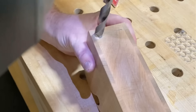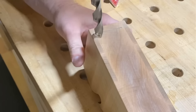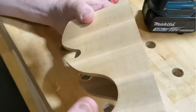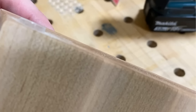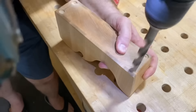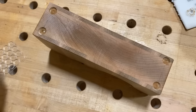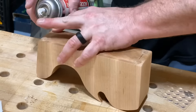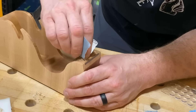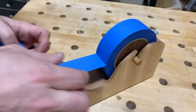Moving on, I'm going to place some non-stick feet in there — these little rubberized plastic feet you can find at your local big box store. They're a little too high, so I'm going to counter-drill some holes so they sit in a little bit more. I actually got this idea from Casey Reeves from C Reeves Makes — I'll link his channel below. He makes amazing cutting boards and just made an amazing coffee table. His trick for cutting board feet is the same: drill in a little and recess the feet. After sanding that area down, everything sticks beautifully now.